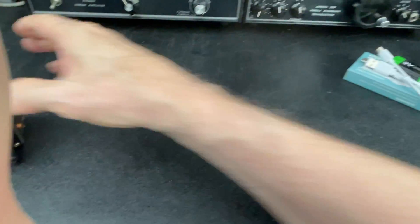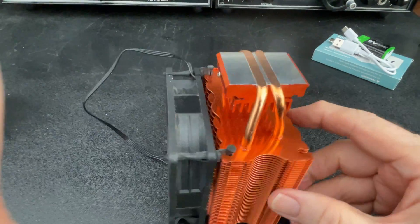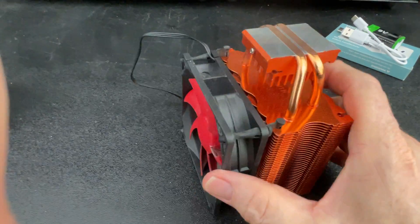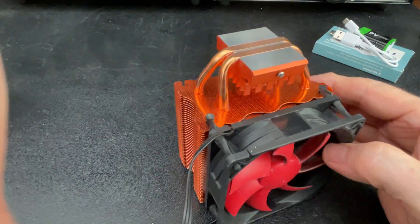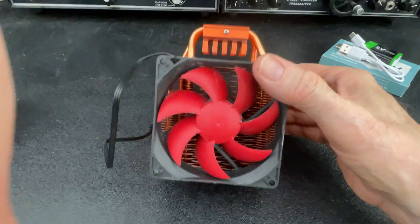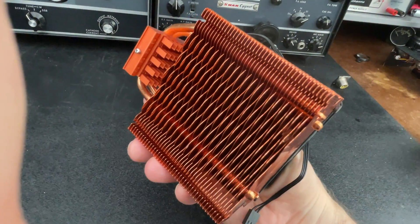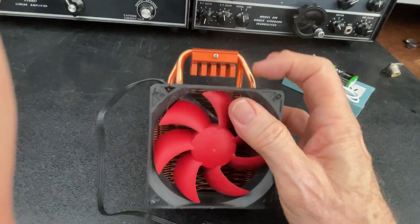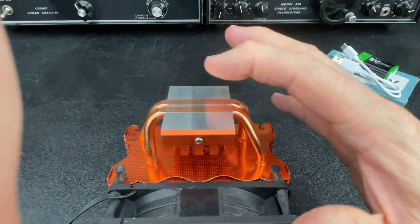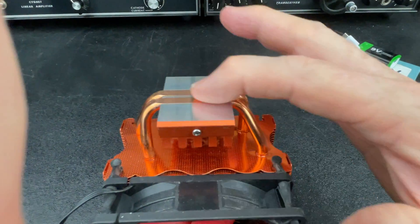The last thing I want to mention is that you might look at some of the different cooler fans from CPUs from desktop computers. If you notice, it's bigger — it has a bigger fan and some really gigantic cooling fins with a heat sink on top. You could mount your flange resistors across this way, straddling these heat tubes.